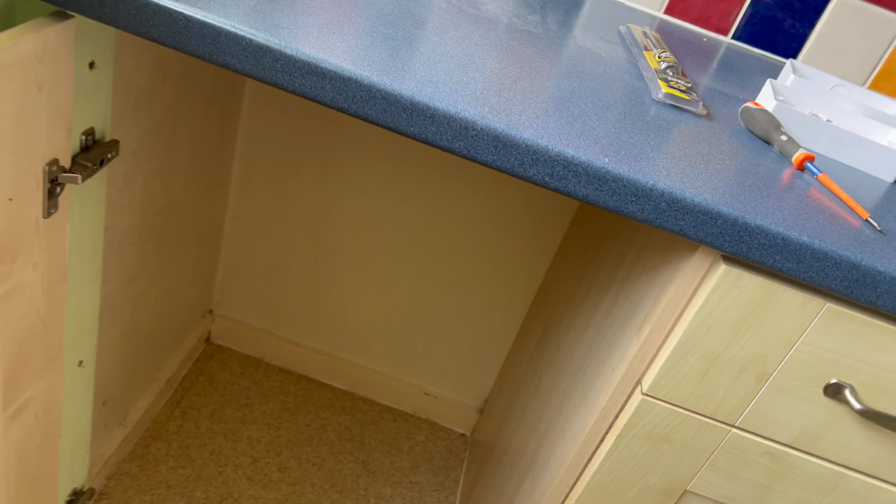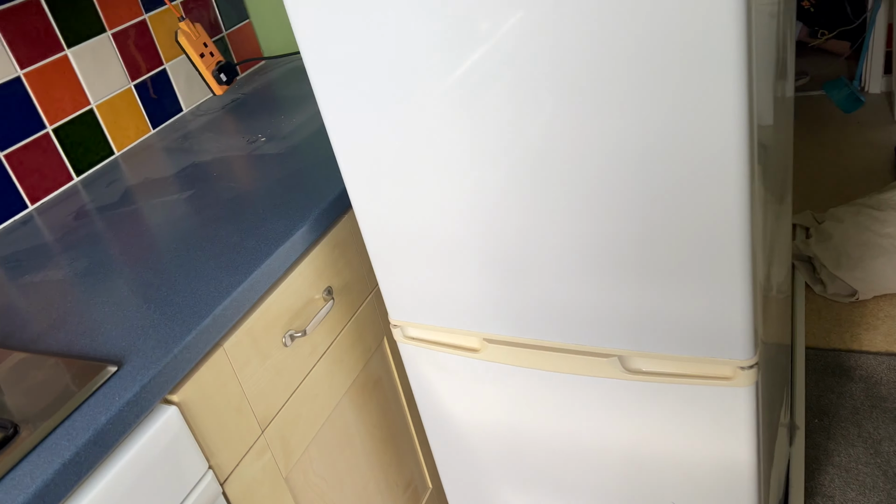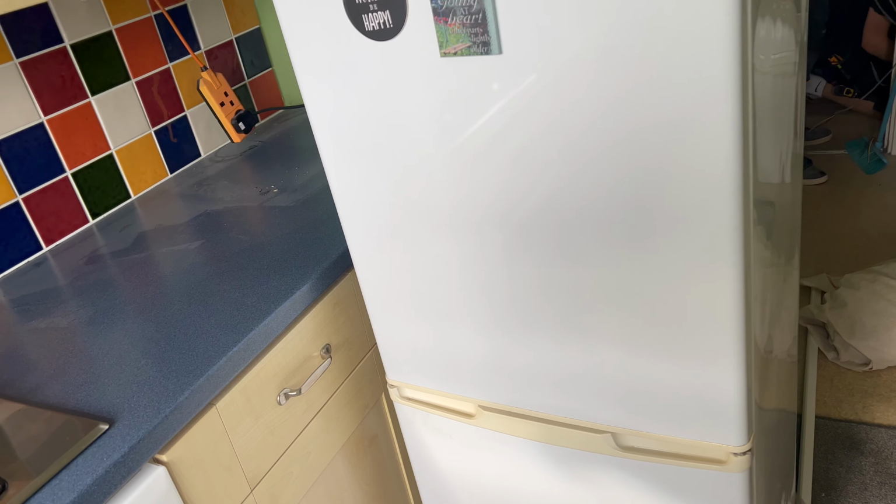It's a bit moody, but we'll just put the trunk in like that and then it goes down. One there, and two along here. Reese is just sorting out the central heating and the fuse board. What we're going to do is wire underneath, and then obviously all these bits we're going to trunk, and then we're going to come down. We're going to put a single socket in for there. We've got a cooker switch for that. We put a single socket in for that. We've got a fused spur across for the canopy.